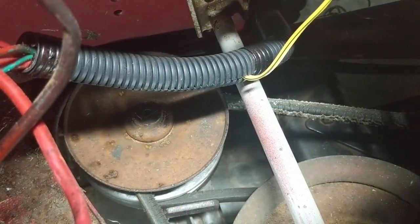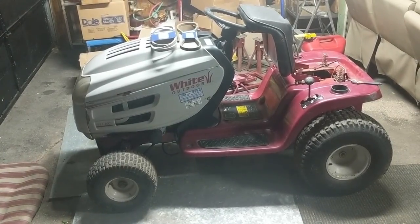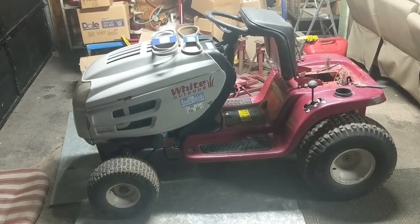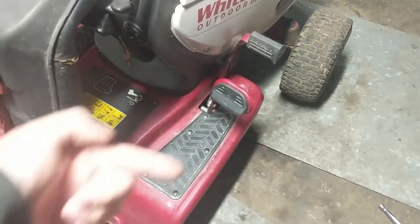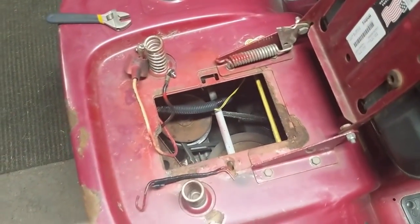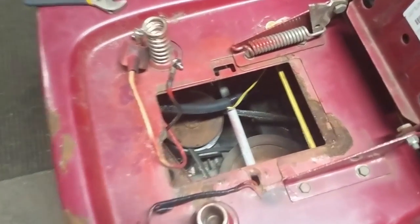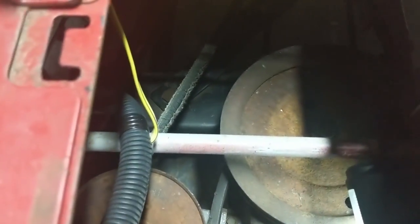We can see that our belts are definitely damaged and in desperate need of replacement, so I've purchased some belts because I got this machine freed up. To reiterate: if your throttle pedal doesn't return, the first issue is normally a throttle return spring breaking — it's a simple fix. You locate your throttle pedal, go underneath the machine, find your spring, and see if it's broken. If that's not the case, move on to your stack pulley, because if that centerpiece seizes in the top position you'll have extra slack on your bottom belt, which is the one that goes back to the engine.